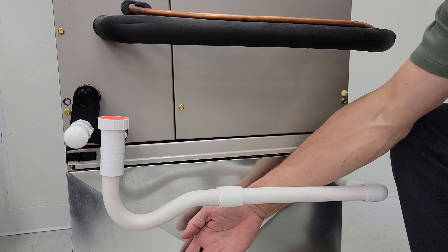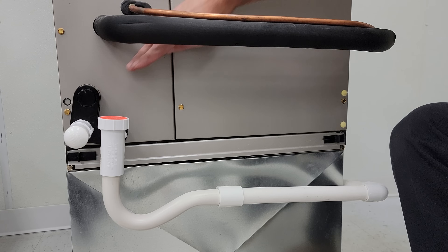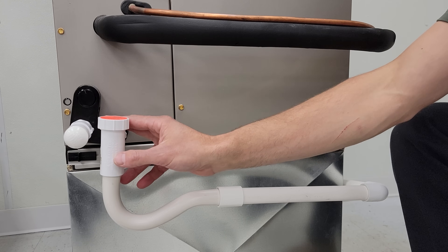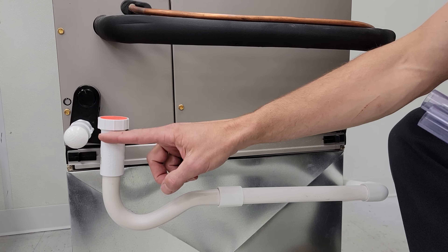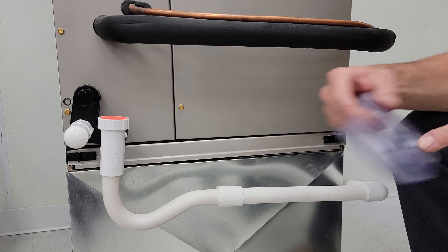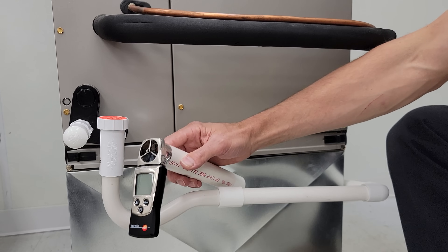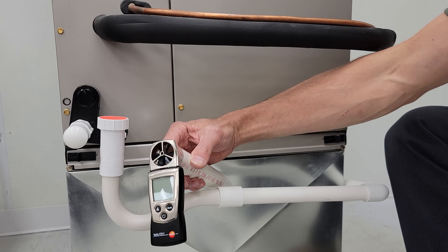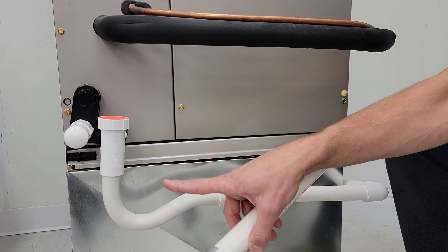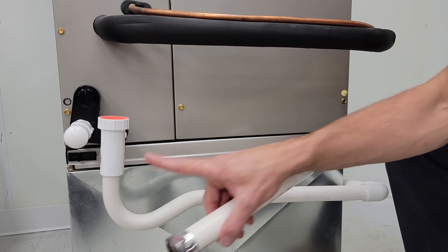On the air handler, we have the air being pulled across the evaporator coil. We're going to disconnect this so you can see the air being pulled in. This is called a P-trap; this is called a U-trap. For all you HVAC nerds, we are also measuring our airflow to determine the cubic feet per minute being pulled in when we don't have a trap. The whole point is: on air handlers, you always need a water trap.